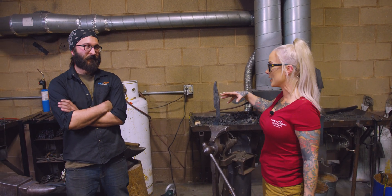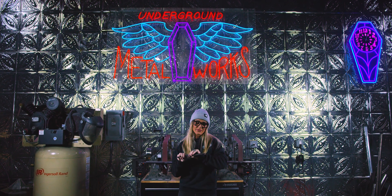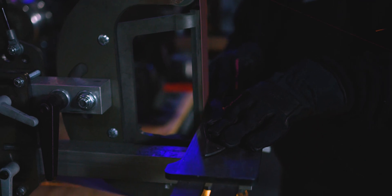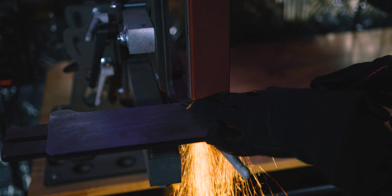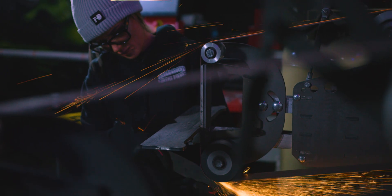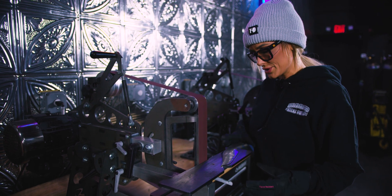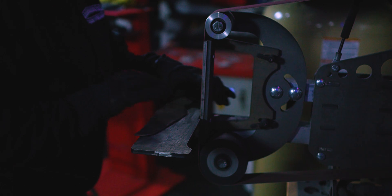We're not going to end up tempering it today — we're going to call it a day for the whole forging process. I really had a great time and I look forward to taking this home and finishing it up. We'll see you next time on Metal America. We're back at my shop now — ran out of time at Rochester Arc and Flame, so now I just need to grind this down and give it a nice sharp blade. Right now I'm just taking 60-grit sandpaper to it, trying to clean it up as best as possible before I start lowering down the grit and putting a sharp edge on this.